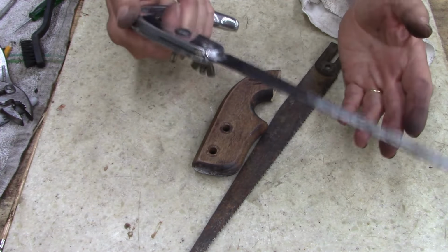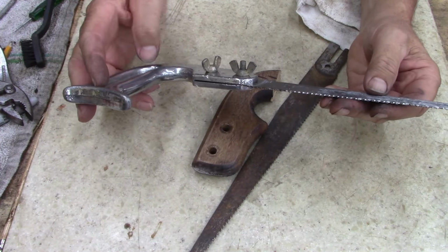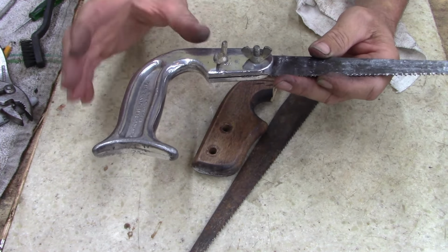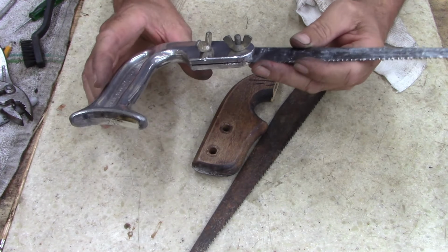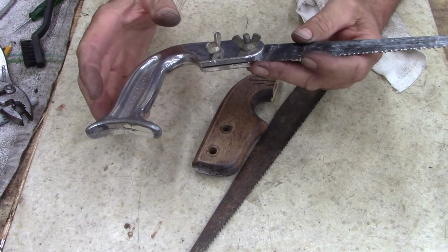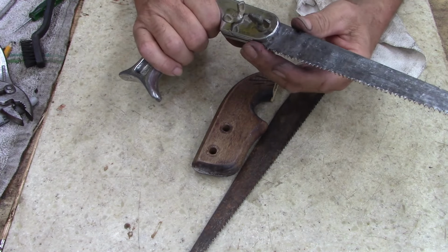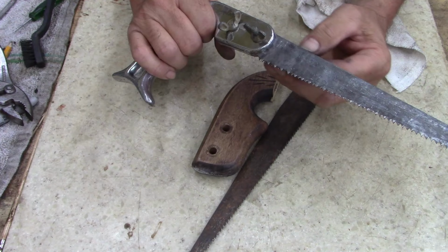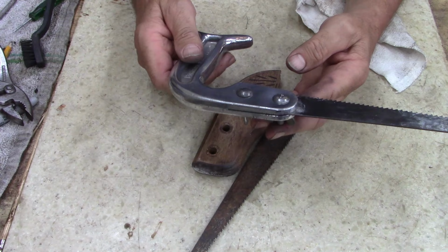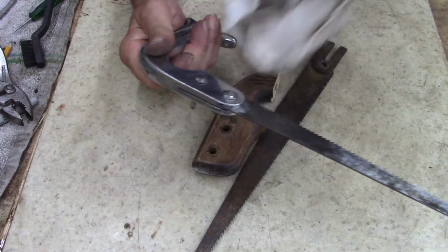Like I said, I use these. Most people do not use these type of blades anymore to cut sheetrock. I do. Like I said, you're working in a facility where you have to keep your dust down to almost nothing. You can't use a power saw, you can't use an oscillating tool. I sometimes have to cut by hand and have somebody hold the vacuum while I'm cutting just to keep the dust almost non-existent. People don't realize you have to have your dust to a minimum in certain areas. There's certain places you just can't use power tools.